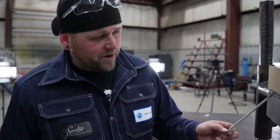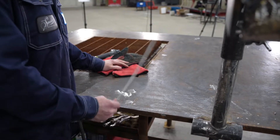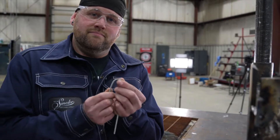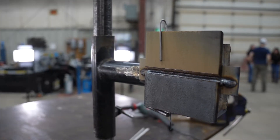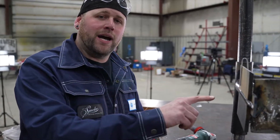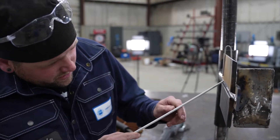As you can see, the soot from my first pass has covered up my mark. There's a quick and easy trick to get around that. I recommend wire wheeling after every pass. Now that it's clean, I'm going to run my first pass on the beveled edge up to my stop.